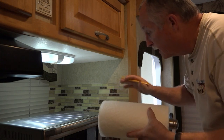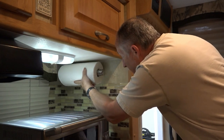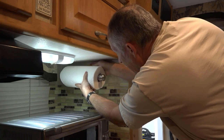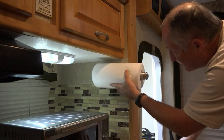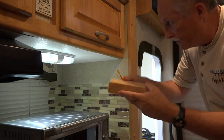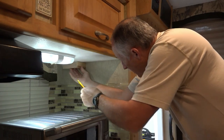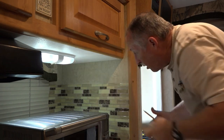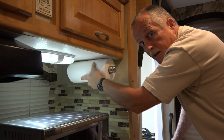The first thing I want to do is find out where I want it — farther back, but if I go too far back I can't get the screws in. So I'm going to put it about there and put a little mark. Now I want to space this down about an inch and a half. I have a piece of two-by-six and I'm going to use it as a straight edge, spacing off this cabinet so I know I have a straight line. So now I know the holes go right on that line and it'll be nice and straight and parallel.